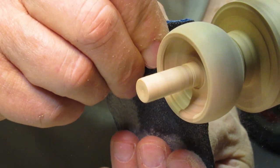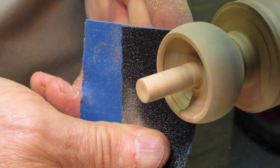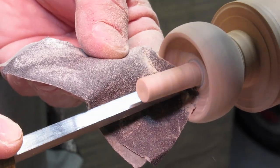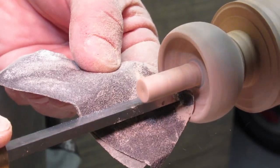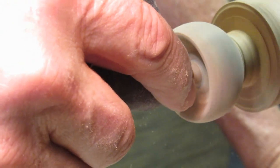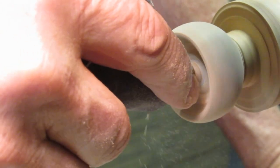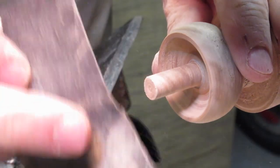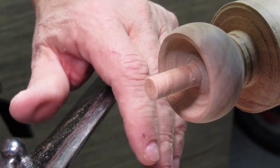I don't want to sand too far over this way, because I've still got to finish this end off. Getting inside is a little tricky — my finger won't get in here, so I got to use my little scraper. You've got to really be careful. You've got to finish this handle up completely, because it's how we remount — reverse mount the tippy top into a Jacob's chuck as a final finish. So we've got to get our handle completely done, got to get a little finish on it.